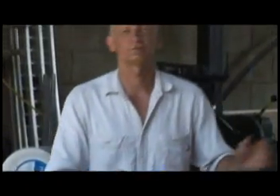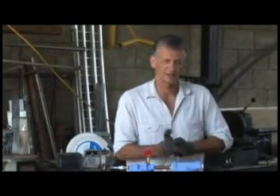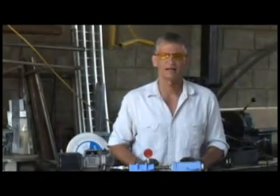Now we have our distilled water in our canisters. We need to add our electrolyte, which in this case is lye. Remember, this stuff is nasty — it will burn your skin, it will blind you. You want to wear gloves and you want to wear glasses. The lye is a caustic chemical. It was used in drain cleaner — they've outlawed it because it's so nasty and bad for the environment. But it makes a great solution for making hydrogen.